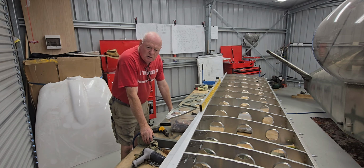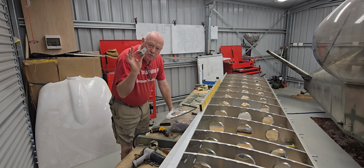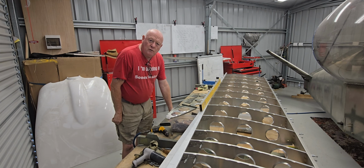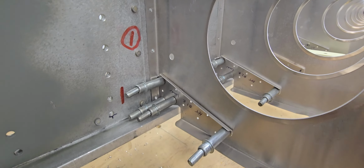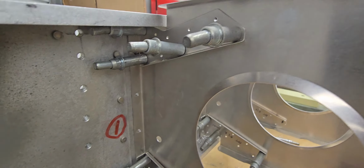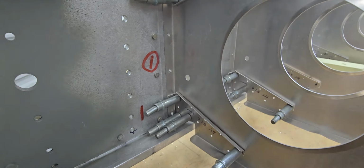So I'm going to work on the remainder of the aft ribs this morning, paint those up, probably reinstall my mounting blocks now that I've primed them all up, the tie down bracket, and slowly, progressively work my way through on this wing to try to get either clecos in or rivets in. So this is why I will be deburring all of these and fixing them off with rivets now,